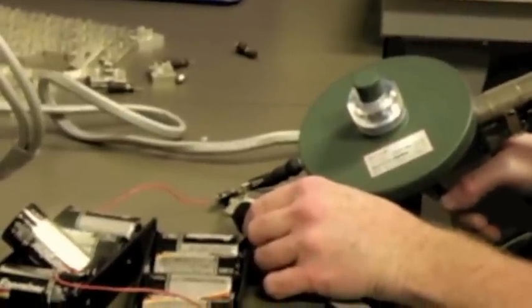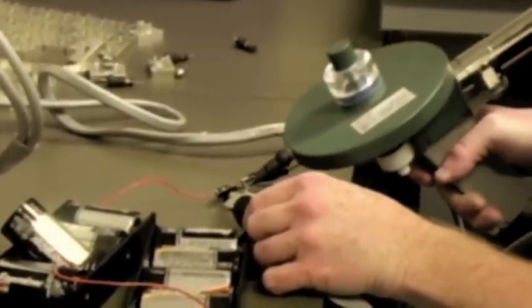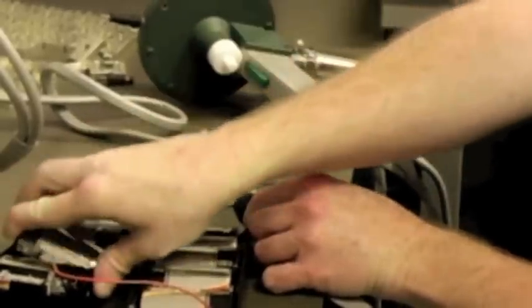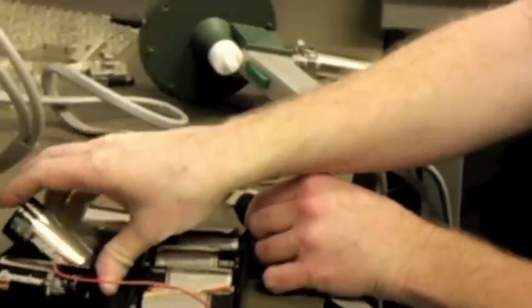You see that? Alright, so we're hitting it with 20 shots a second — 15 kV ESD — protected by Lasorb. When we activate the battery power supply here, you can see that it's still lasing with no problem.